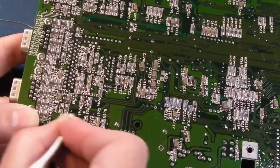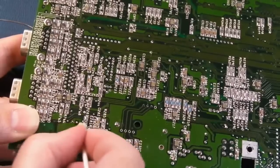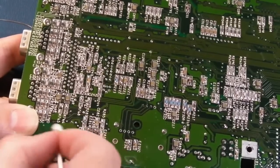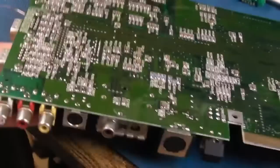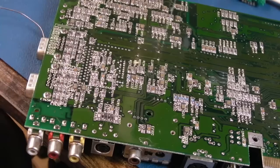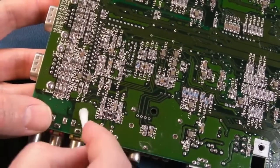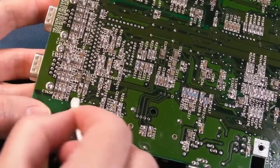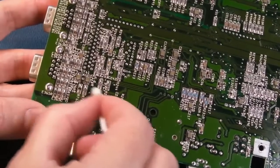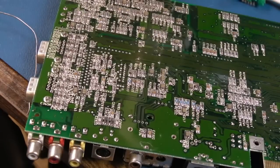And in case you're not aware, when you're looking for caps for something like this, if you want to source the components separately rather than buy a kit, have a look on somewhere like DigiKey and it will list the number of working hours a cap is rated for. Because they're not all the same. You pay more for a cap that'll last 5,000 hours or 10,000 hours or more than that. Sorry, that is at a certain temperature. They're rated at like 5,000 hours at 105 degrees, for example. Well, that's going to be a blooming good cap compared to one that will only last 1,000 or 2,000 hours at 105 degrees. So it's just something to think about.